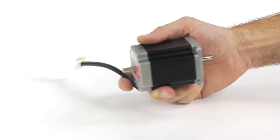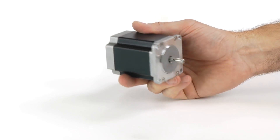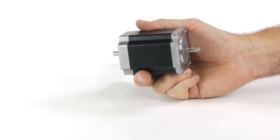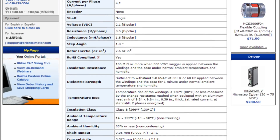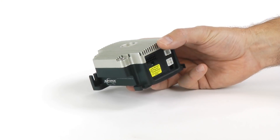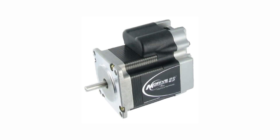If you're planning to use a NEMA 23 stepper more along the lines of this Oriental Motor stepper or bigger, or if you're currently using a servo system, then it will probably make sense to look at ClearPath. This Oriental Motor stepper, derated according to the manufacturer's recommendations because it runs open loop, puts out about 23 watts. Along with this Oriental Motor drive, the package costs about $346. This Schneider drive is a similar price and power. Schneider also makes integrated steppers — this one, after proper derating, puts out about 56 watts and costs about $430.